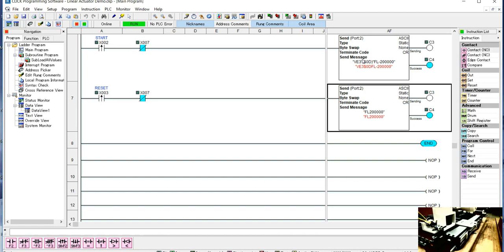Now, the other thing that we have to be aware of when we're doing this, and I'm just going to move it in 10 revolution intervals, and then I'm going to bring it back a little bit. Now, it just stops at that. And I don't know if you can really tell, but it is not stopping at the sensors. So when I come back this way, it passed the hopper sensor, and now it's just beyond the hopper. And now it's going to stop, and now it's not even close to the first sensor. So you can see it's just stopping when the steps have been taken.